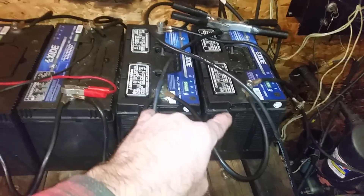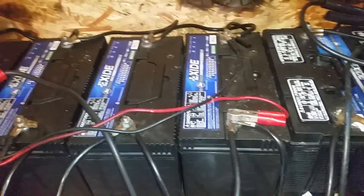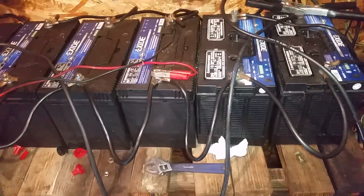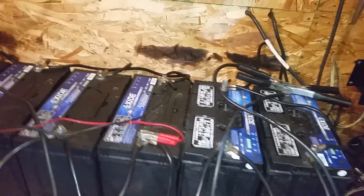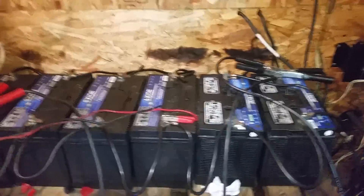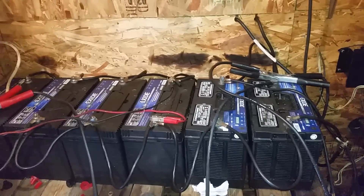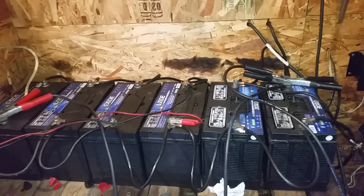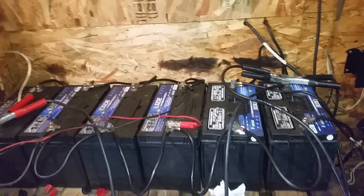Two of them I can check the specific gravity — the rest I can't. Maybe I can pry the tops off of those or something. They're from May of 2013, so they should still be alive, but if they've been taking them down to 10 volts on a regular basis they're so sulfated. Really the only thing we could do is put big amps on them and work these batteries day after day. First we've got to get them as full as they can get, then take 10% off of them, then put 80 amps on them again — do that over and over to see if we can desulfate some of those plates.